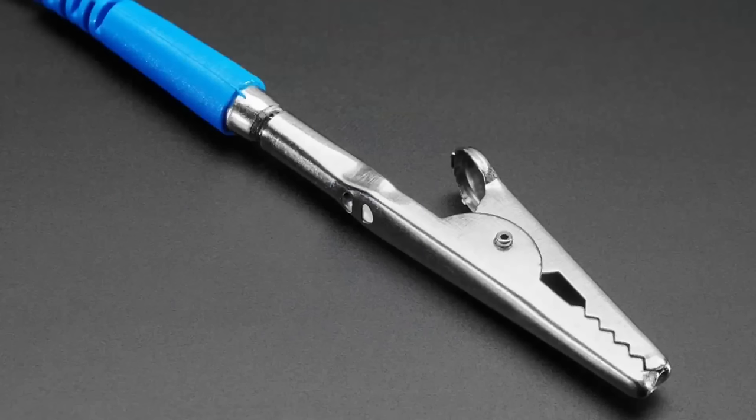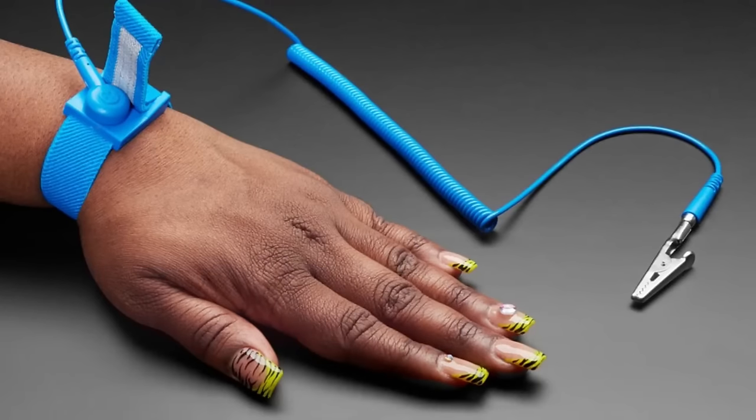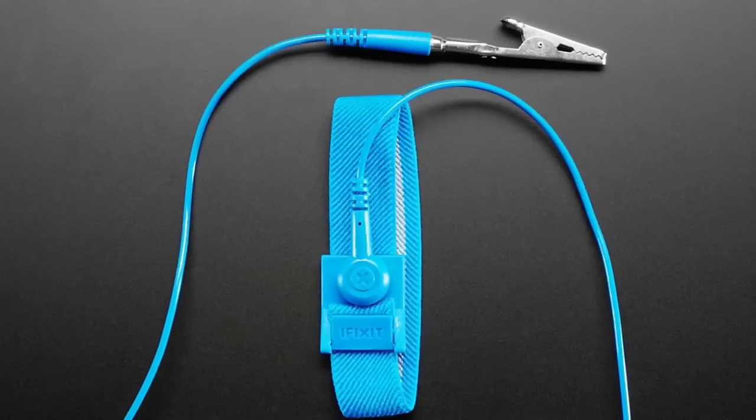They also make a really nice anti-static strap. Not only is it a very good anti-static strap, but it will fit larger wrists than most off-the-shelf ones — many are made for smaller wrists common in Asian electronics manufacturing. This one is adjustable for bigger wrists. Don't forget you have to clip the clip part to an earth ground; a lot of electronics workbenches have an earth ground point you can connect to.